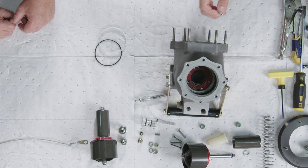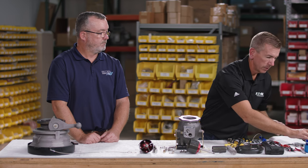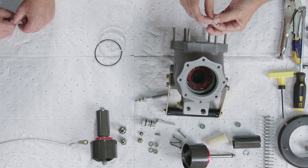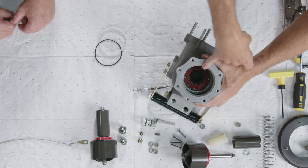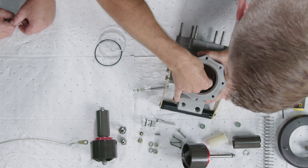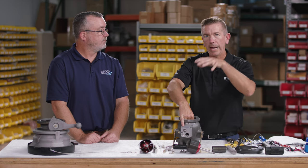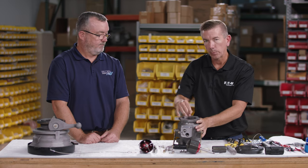Put a little bit of petroleum lubricant on the O-rings — just a thin film to help with installation. The crossover tube goes into the offset hole. When inserting, go straight up and down to apply even force. If you go in at an angle with such a small O-ring, you'll cut it and won't know until the coupler is fully assembled and showing bypassing issues.